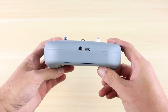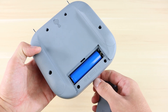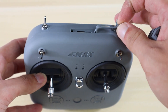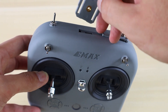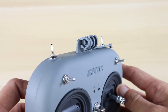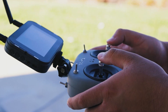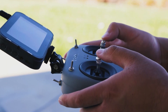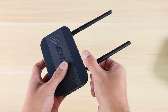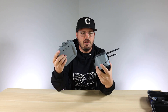It's good for people who either thumb or pinch — I'm a pincher, so it feels pretty good. You've got four switches, USB charging on the bottom, and it runs on a standard 18650 battery just like our old transmitter, so you can get spares and swap them out. Up on the top is where you slide in the screen mount, which locks into place so you can screw your screen in and you're ready to go. The screen also comes with two standard dipole antennas included.